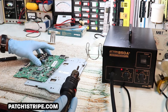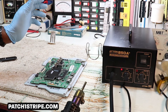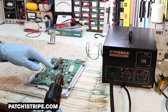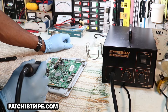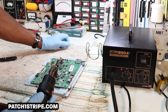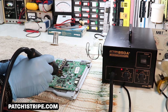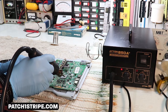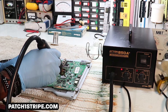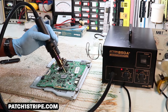In this demonstration, if you remember I had a heat sink on top of this — I took that off so I could get to the BGA itself. If I had this and all I had to do was my reflow, this is what it would be. I just go at a nice slow pace to heat everything up.